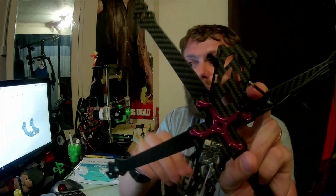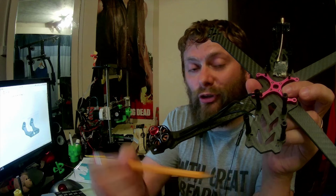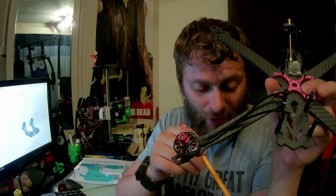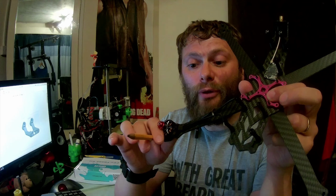The U-shaped mount that RunCam give you in all their cameras, there are no holes that I can use in the front or the bottom of this frame here. So what I'm currently planning on is, between the four standoffs, I'm going to print a small TPU shelf that the RunCam hardware will screw into, and then have 2 bits that run up towards the camera and the camera mount into that. That should give me a nice mounting platform for the camera, and as a side note, being TPU, it will have a nice little bit of dampening effect, so it should help with any jello.